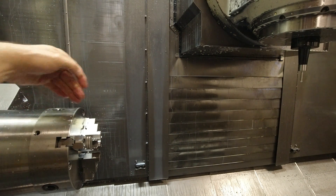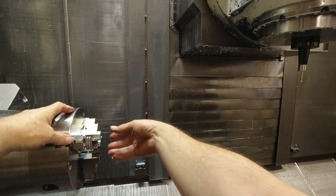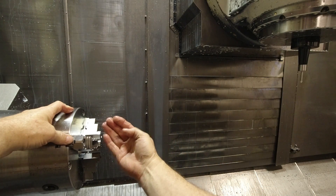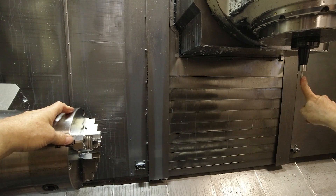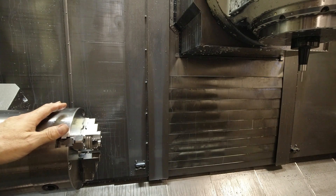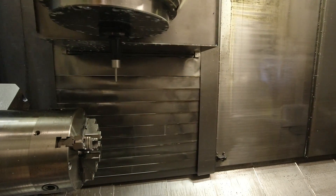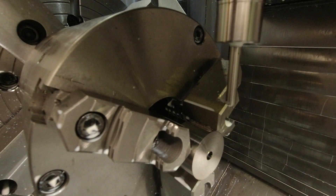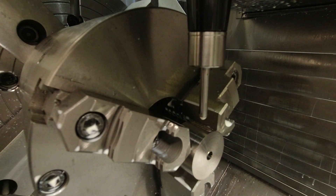I positioned the machine intentionally with the C axis at 90 degrees, because the zero point is actually 90 degrees this way and rotates back. So I positioned it with the C at 90 degrees and brought this tool with this gauge pin that fits my slot up here on Y0, up close to the part at the end of the program, so that I could just jog it up and position it close to the top of that slot.